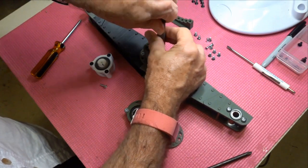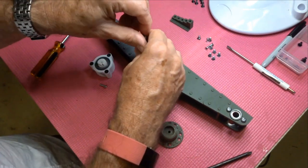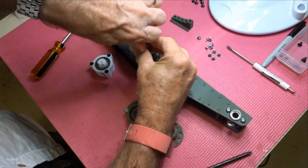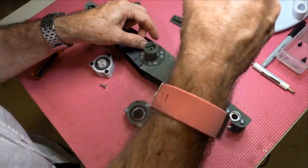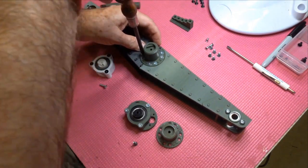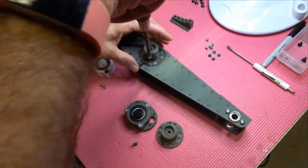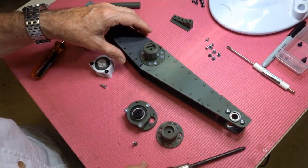You could use 10mm long M4s, it wouldn't make much difference. These screw threads go all the way through the arm. So if you think to yourself, an 8mm one, no, I need 10, I'm going to give it maximum strength, well, go right ahead. Probably make them 14 if you like, it wouldn't really matter. Okay, you want these to pull down and make sure the faces are well mated underneath. Don't have to be the tightest things in the world. The loads on these are all in shear. They're not pulling out, so that's why an 8mm one's okay.